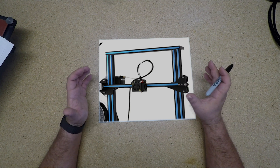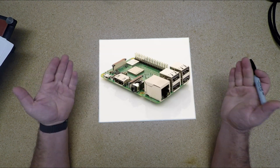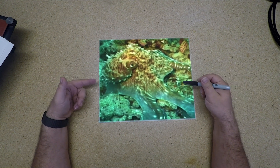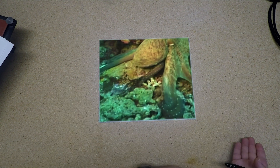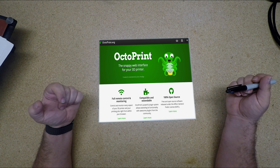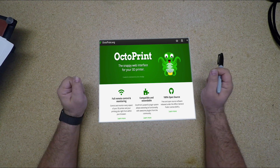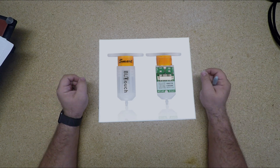For the final bits of this upgrade, we are going to add a Raspberry Pi — a Raspberry Pi 3B+, inexpensive at $35 — and we're going to be running Octoprint. We're also going to get rid of that box and make it a lot quieter by putting in Noctua fans from the gaming industry. And we're going to be changing the firmware and adding auto leveling through a BL Touch auto leveling sensor. So this should be a pretty fun build.